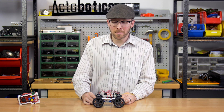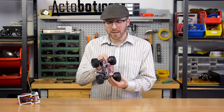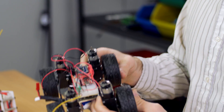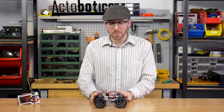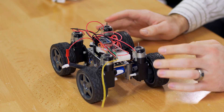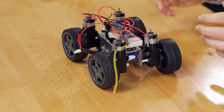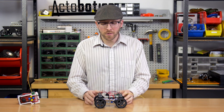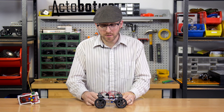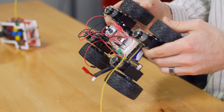I'm taking that and mapping it to the directional control of the motors, and it's speaking to this motor controller here, which is a $6 motor controller that can handle up to three amps per channel — more than enough for these motors. These motors will actually only draw a quarter of an amp per motor at stall, so if all the motors were stalled at the same time, it will only draw one amp altogether. This little $6 motor controller will control these motors great.